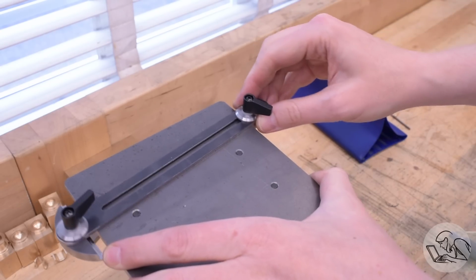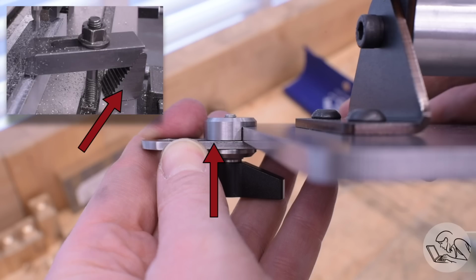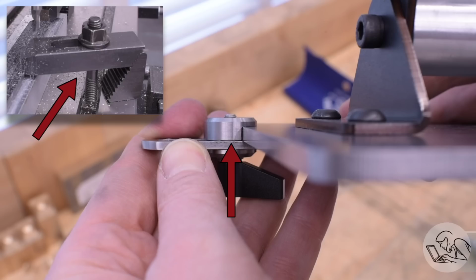Very nice. Let's take a look at that clamping piece from underneath because it's really neat how this actually works. On the far left of the part, it's full thickness there, so there's kind of like a foot there, if you will. That's sort of the heel of a strap clamp like on the mill. And then in the center is a little clearance, that very shallow shelf that we cut. And that's underneath the screw that's doing the clamping. Again, just like the center area of the strap clamp on a mill. And then way out here on the right edge is the thinnest area, and that's where the actual toe of the toe clamping is happening.